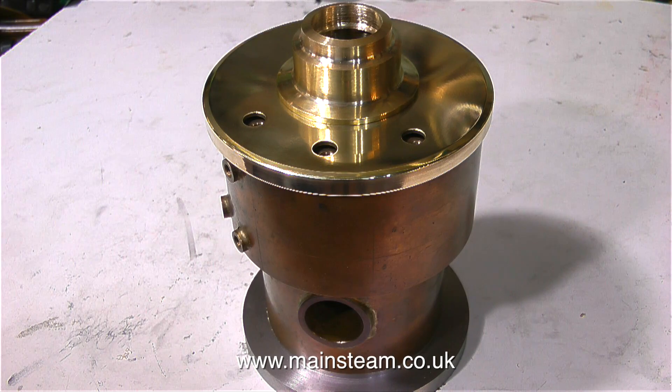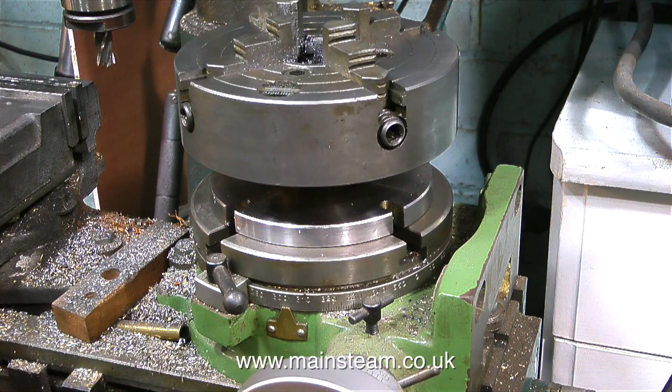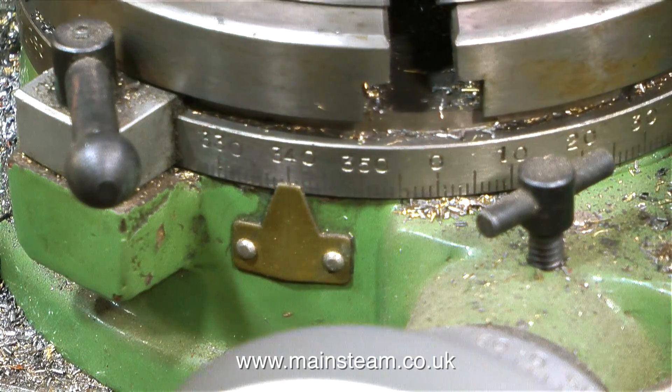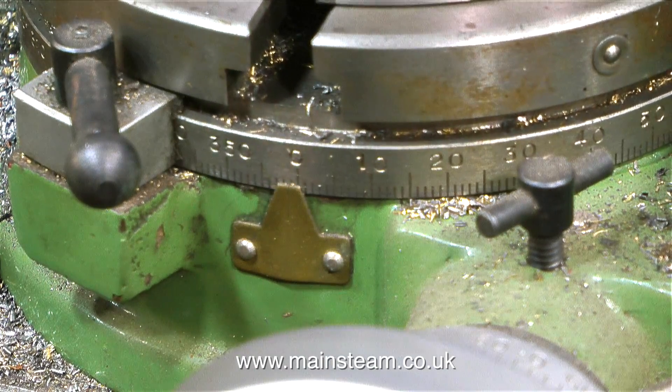Just looking at it should tell you how to make it. I made it from a solid piece of brass, so now there are very sharp brass chippings all over my lathe, all over the floor near the lathe, and some of them are in my finger. I can't decide whether to use bolts or rivets to hold this part to the top cap. Either way, I'm going to drill the holes using this thing — it's called a rotary table. It also has a four jaw chuck on the top, and it has degrees around the side, 0 to 360. I will be covering the use of this in detail when I start to use it.